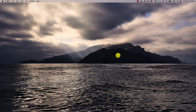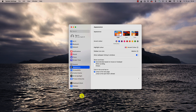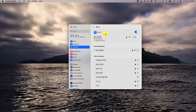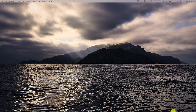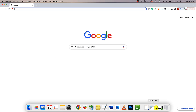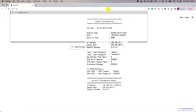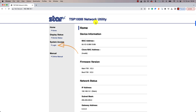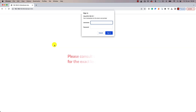From their computer or mobile device, they need to open System Preferences followed by Network. Restaurant owners should click on Wi-Fi, then select the network of the thermal printer and click Connect. Once their device has established a connection with the restaurant printer, they should open their web browser. In the address bar, restaurant owners need to type in the default address of the thermal printer, which can be found on the receipt they printed earlier. In the left navigation panel, they should click on Login. The default username is Root and the default password is Public.